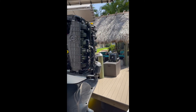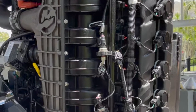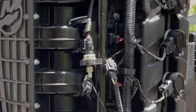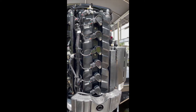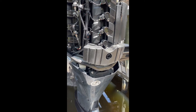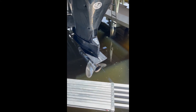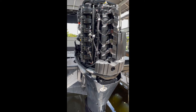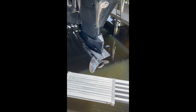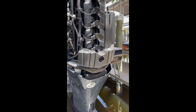It's an inline six on the backside. The fuel rail — that black pipe going up and down right there — is your fuel rail, that's where all the fuel comes in. And as you continue around the engine, there are six spark plugs underneath those coils. And this thing right here is an exhaust baffle. When you're in gear under load, most of the exhaust goes through the propeller. When you're at idle, the engine doesn't produce enough force to fully push the exhaust underwater, so it comes through the path of least resistance, which is designed to be right here, out the back.